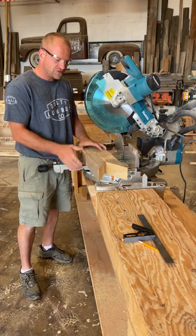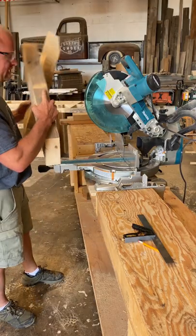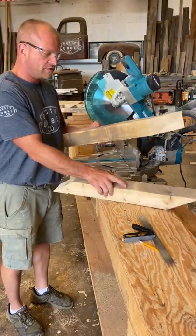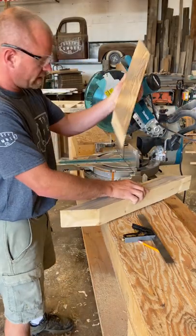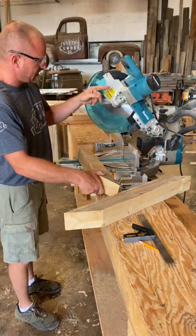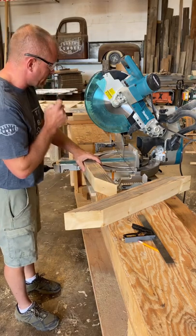Setting your chop saw for cross laps. I've got this X-accent that I'm making for the kitchen cabinet. I've already milled my boards — they're already uniform and square. I've marked out the area where they're going to lap over one another and marked the halfway point on these boards. What I need to do now is set my saw so that it only goes down halfway, and then I can cut out all that material.